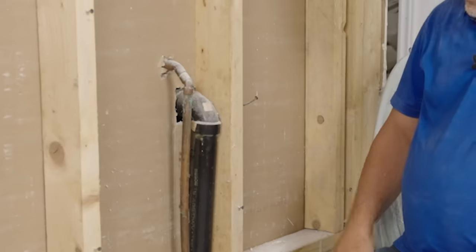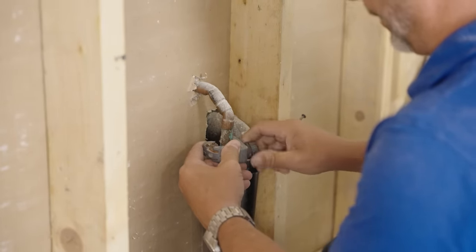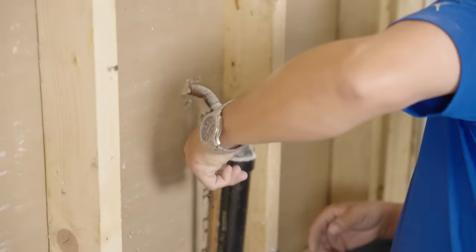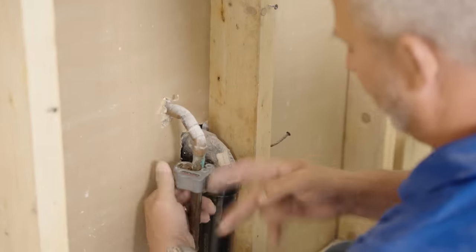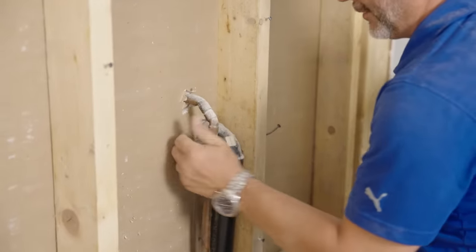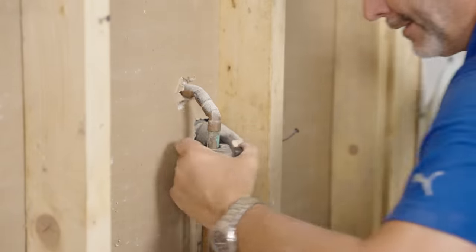It's usually only a few ounces of water. We're working in a tight space, so I'm just going to use this little mini cutter. It's a bit of a pain to work with — grabbing a wrench to turn the handle might be beneficial if you don't have enough finger strength. Basically, we just have a cutting wheel under compression and you roll it around in circles. It score-cuts the copper. Turn it a turn and then turn the wheel a quarter to increase the depth. And we're through.